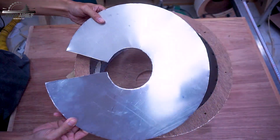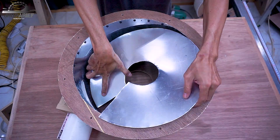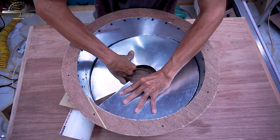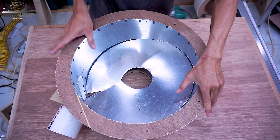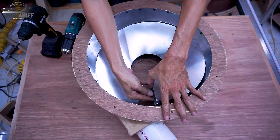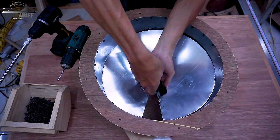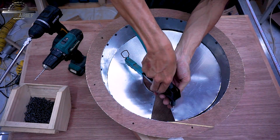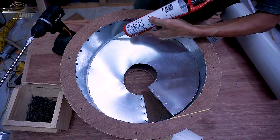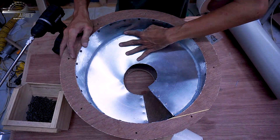The next step is to build the best part for this cyclone - the cyclone effect. I call it the cyclone effect because it twists the air down, twisting and pushing the air down using a fin. If you see what somebody else built without the fin, the air and dust circles too much, but with this fin it pushes down to the bin more quickly and fast. The circulation of the air is going to be faster. I also add a bracket to make this strong, plus another shield with silicone - the silicone actually holds this structure more strongly.